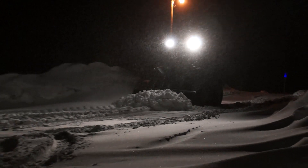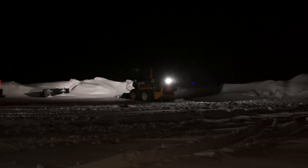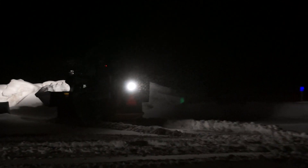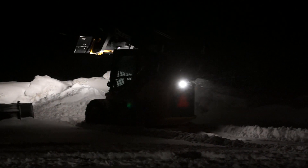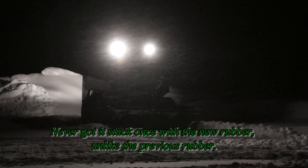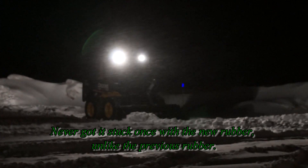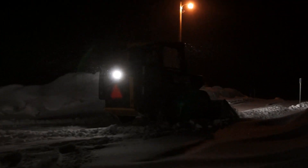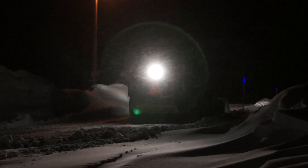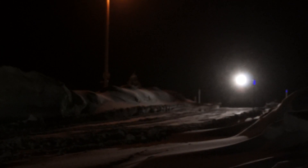We try not to dig into the gravel. This is one of the first snows of the year, so she's trying not to dig into it. You get these January snows, and sometimes they can be quite wet and quite heavy, and this being one of the first ones of 2014, we really just don't want to chew up the driveway until we get our base pack down. So basically, she's keeping that bucket up a little so she doesn't pick up the gravel underneath. But as you can see, these tires aren't giving her any trouble at all. Now, granted, they are new — I'll probably put out a video in a year or two once I've worn them down a bit and kind of see how they perform then.